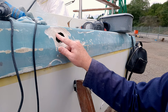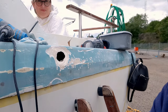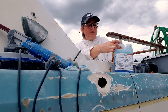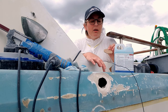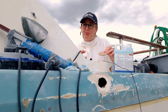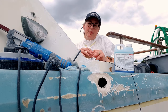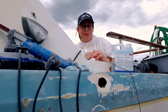So perhaps my darling, you would like to tell the world what it is you're doing to fix it. To fix this problem, we're going to take a bit of cardboard and coat that with very lovely blue PVA. Then we're going to stick that to the inside of this hole, which we can access just through the hatch here on the inside of the cockpit. And then we are going to put some fibreglass down — probably chop sheet, resin, then some more chop sheet, some more resin. And then once that's all dried up, we are removing this. I'm going to put gel coat on top, probably white to start with just to fill it up a bit, and then we'll finish it off with the Trident Blue gel coat.